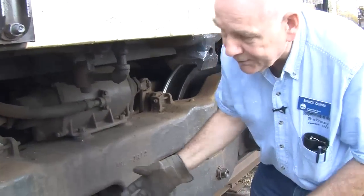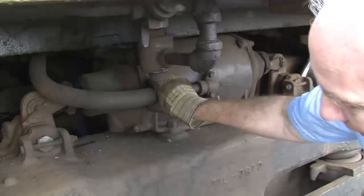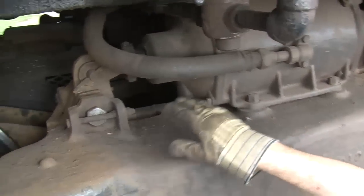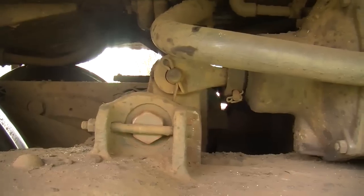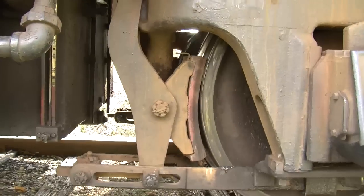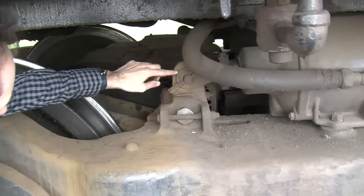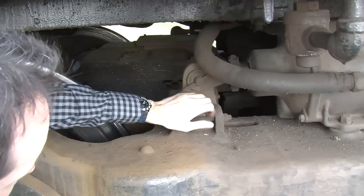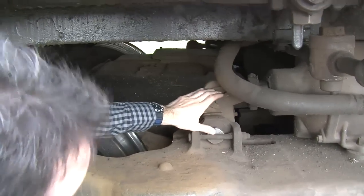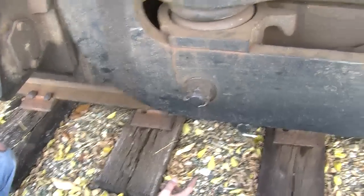Okay. It's really kind of like a big erector set. But when the air is applied on here, this cylinder, as we'll show you later, will travel, and that moves the linkage down through here, which compresses the brake shoes against all of the wheels. Now this is the fulcrum. This is actually bolted through right here, and this doesn't move. This piece here twists like that. Right. So there's a massive amount of force there, because that lever's really long. So that's got to push that all the way out. Well, and you've got it there, and you've got it up here. Yeah, it goes both ways.